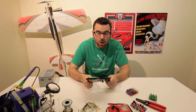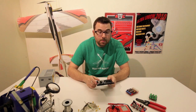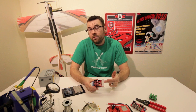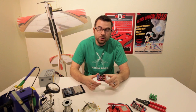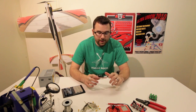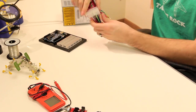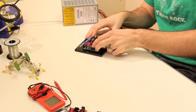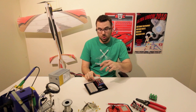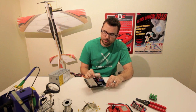So you've had your Arduino for a little while now, you've done the inventor's kit, you've made an LED blink, you've spun some motors, but you want to move on to something a little bit bigger and a little bit more high current. BAM! The high power shield. This allows you to take 12 volts in, control them with MOSFETs, and really you can control some very high current stuff — I think the traces will burn up before the MOSFETs will. Basically how this works is you have a computer power supply that you connect into one end, and then after you plug it into your Arduino, now you have PWM pins that you can control 12 volts high current instead of the measly little 5 volts and low current that the Arduino gives you.